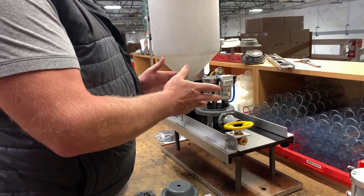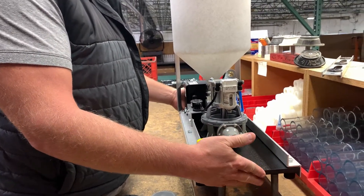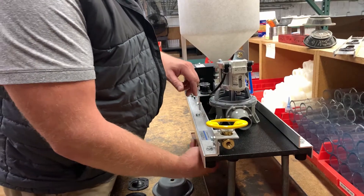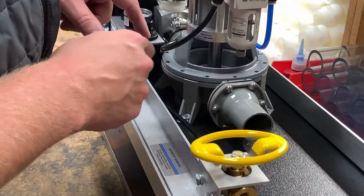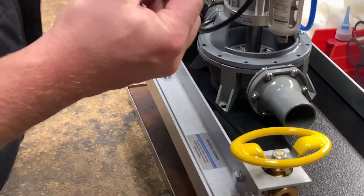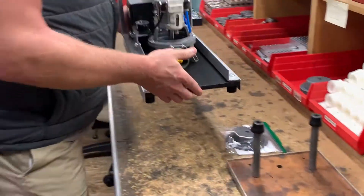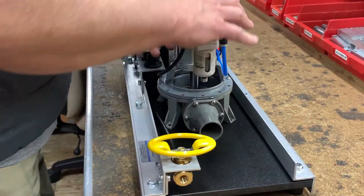With the air pump you've got to be a little more careful because you have lines and components that are expensive — you don't want to damage or break them. I'm going to put this pump down on the workbench as if it were in the field. You also want to take out your four one-inch cap screws that mount the pump body to the baseboard. With the lock washer and one-inch cap screw removed, that releases the whole body and you're free.